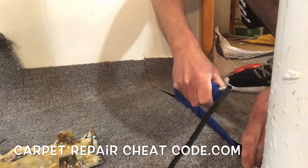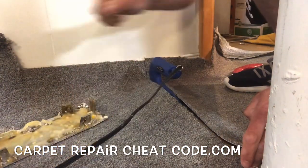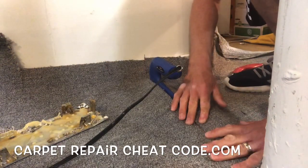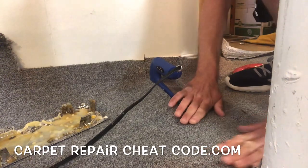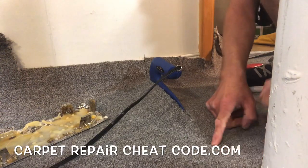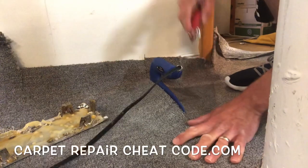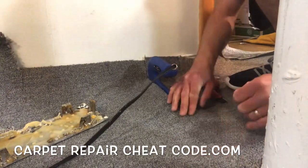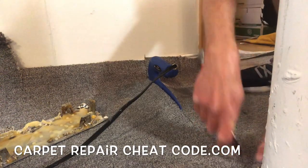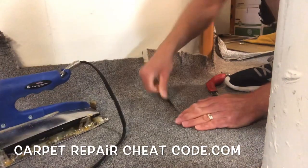So we're going to go ahead and pinch the back there so the iron doesn't pull the tape with it. We're going to move it forward, drop one side down, and then create a small swoop effect so it just picks up the slightest bit of glue and puts it on the edge of the carpet. This is a technique for sure — if you overdo it, glue oozes through and you have a rock solid seam. So just a little bit of finesse. Move that forward, make sure everything behind it is put together. If you see any fuzzies popping through, just take the edge of your blade and tuck them down into that seam.